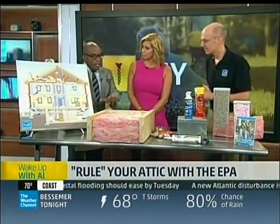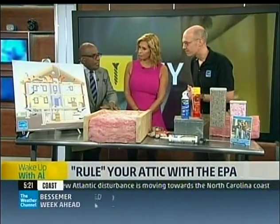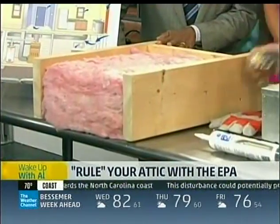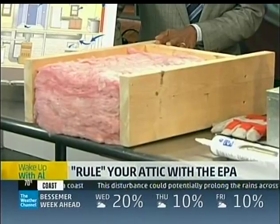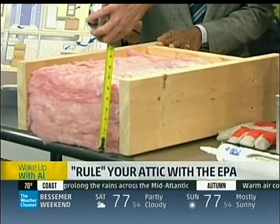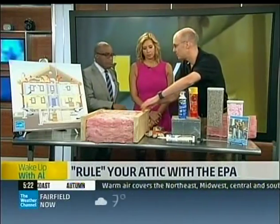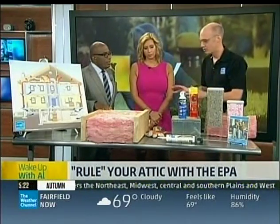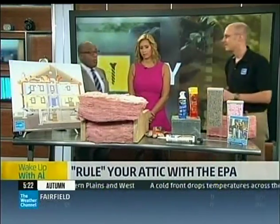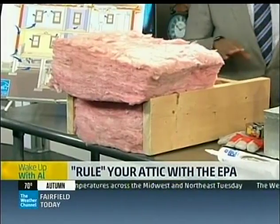So if you decide you want to do this yourself, how do you make sure you've got the right amount of insulation? And does insulation lose its effectiveness over time? Typically no. Sometimes it can settle, especially the old kind. These kinds are all designed to really keep their fluff over time. Just getting a ruler or tape measure — we're asking people to go out and try this, we're calling it 'rule your attic.' Get out, measure the insulation, see how much you've got. If you go up in your attic and you can see the tops of the joists, these beams, that means you probably have about half the insulation you should. This is about the amount you should have — you should bury those joists. Yeah, because usually every attic you walk on these beams. That's the right amount; that's going to save you the most energy.